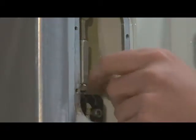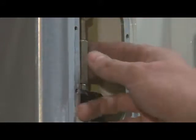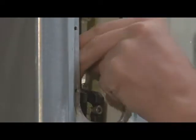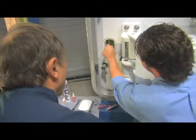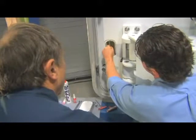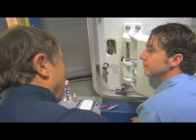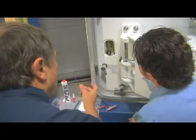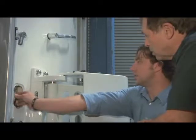You go the opposite way with those two wrenches to undo the turnbuckle. Then just feel it tighten up — turn that right by hand. What you want is about an eighth inch of tension either direction on the chain. When we first got into it, it was quite loose — a lot of wiggle back and forth — and that causes even more slop on the front part of the door. We're going to come in here and take that slop out by making these adjustments. And it's as simple as that.